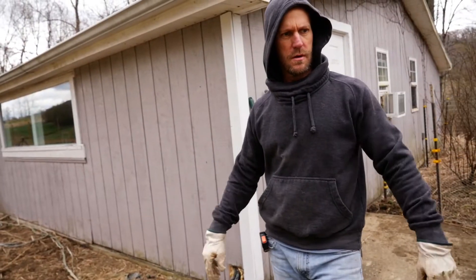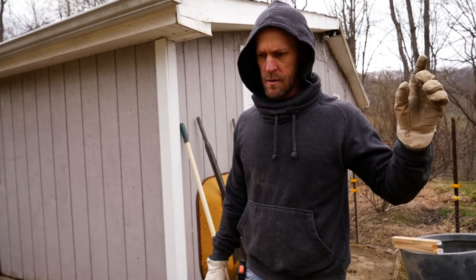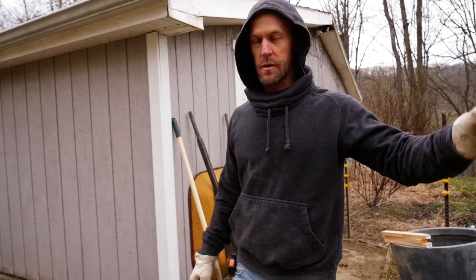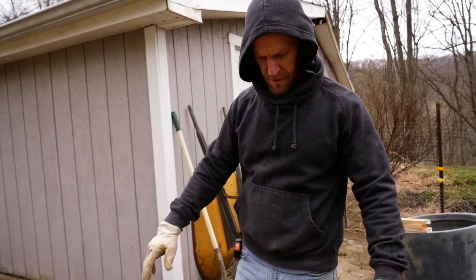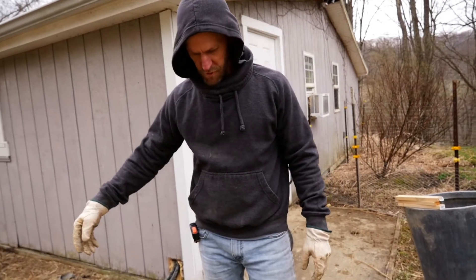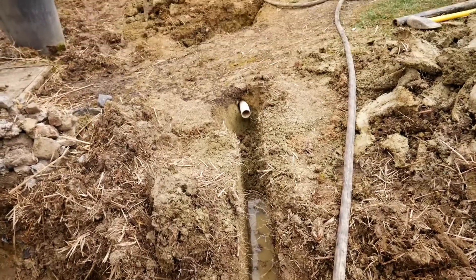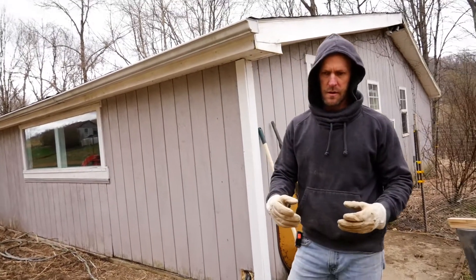I'm rerunning this new feeder cable from our house to the storage house. So I've got a trench and everything, but I didn't want to dig this pavement up, so I actually drove a pipe under it. The way I did it, I actually drove a metal pipe under it, and then of course it packs with dirt.